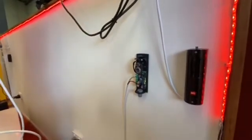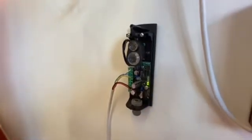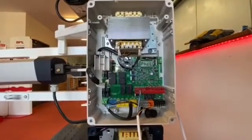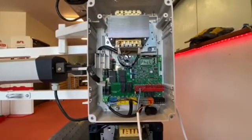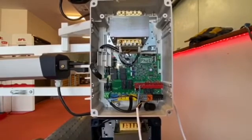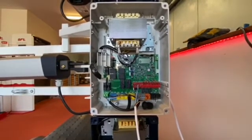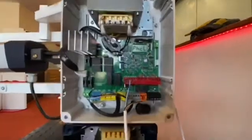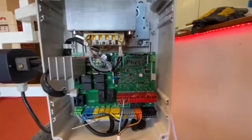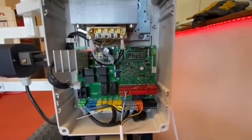This gate will automatically close shortly. The LD2 light came back on — I'm breaking the photocell with my elbow as I'm doing this demonstration. Once the gate starts to close, it registers the open and photocell PHCL status — photocell on closing only. That is letting you know that the photocell is working and that I've got the photocell broken, so the gate won't shut automatically onto a vehicle. I've moved out of the way again — it's registered the gate's open. I'll move into it and it registers again that I've broken the beam, so the gate will safely stay in the open position. Hopefully this video has made sense and helped you out in the field. Looking forward to your feedback — have an awesome day.